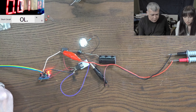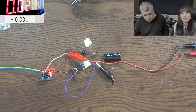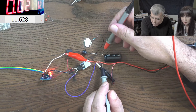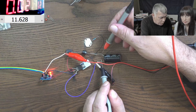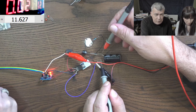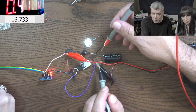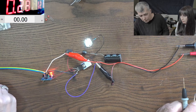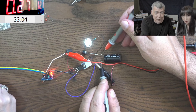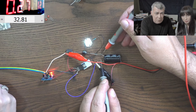Okay, it's quite high — try to lower the current. Spin that knob down. Good, now I'll check with the voltmeter. So that's the output — we have 11.6 volts, basically the input voltage. Now raise the duty cycle — wait, wait, wait. What's the voltage? 33 volts! You see? You have 33 volts with 12 volts input.